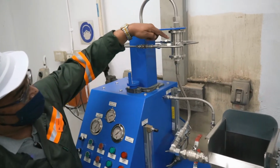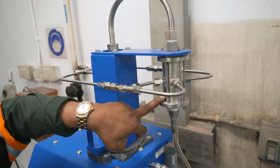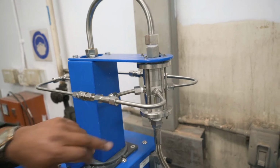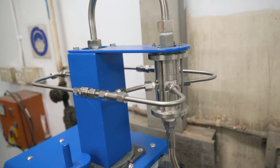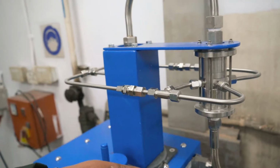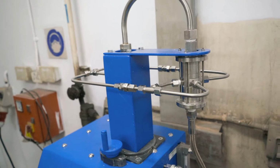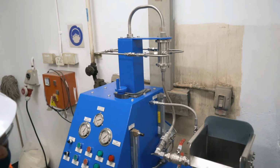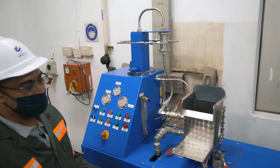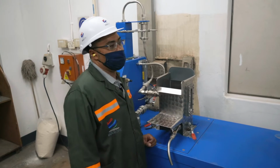It has high-speed venturis built into it and a collection venturi built into it. It's an exact scaled-down model of a larger reactor. So there's no simulation in here. There's no compromise. The internals of this MACH is exactly the same as the units that do 3,000 cube an hour. So it's quite an achievement to have such a small test rig, and it is the only one of its type and kind in the world.